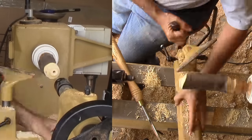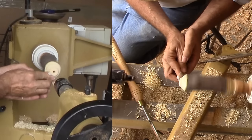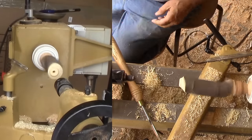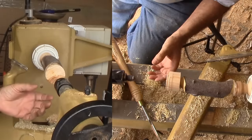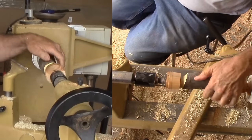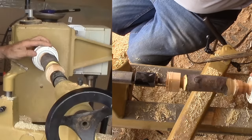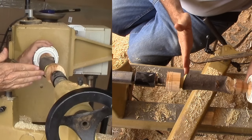Just a little more touch up. I'll sand and finish this little section using mineral oil and beeswax for a finish. I'll never be able to exactly match this axis again. I prepared in advance a small scrap cylinder with a short tenon sized to match the hole that I had drilled. The tenon is long enough to keep the scrap from wobbling. Since the scrap is larger than the end of my spindle, it should give me ample opportunities to adjust the turning axis and maintain the live center support.